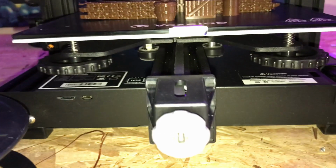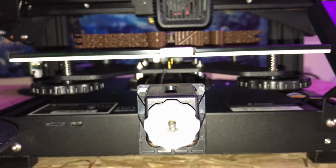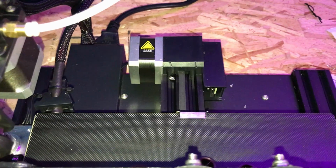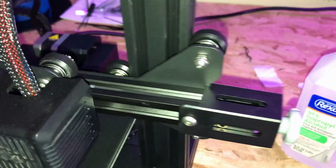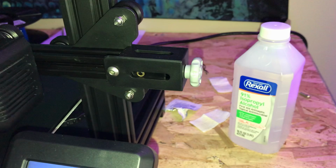Just to give you an idea, underneath you can see the roller mechanisms as well as the adjusters for bed leveling. On the back side of the machine is the motor for this Y-axis control. You'll see it back here. Again, a high quality motor. I haven't seen any issues with it, and once the belt tension is correct, it runs great. Over here on the right-hand side of your X-axis, there is a belt tensioner, and there's also one down on the front for the Y-axis.